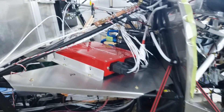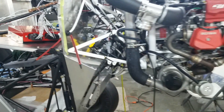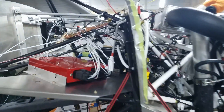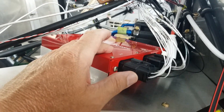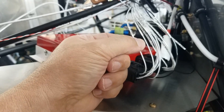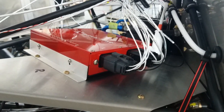Over here at the V-Power — as far as your power, this replaces breakers and everything. You feed one main power into your Vertical Power, and all the power for everything on the plane comes out of here. You just plug it in. You tell the box during setup: if this wire needs to be a 3 amp breaker, it assigns it as a 3 amp breaker. If this one needs to be a 7 and a half amp breaker, you assign it as a 7 and a half amp breaker. It's really easy to wire the power side of things.